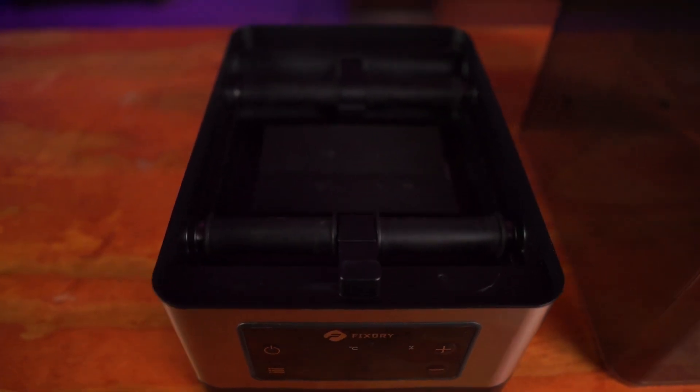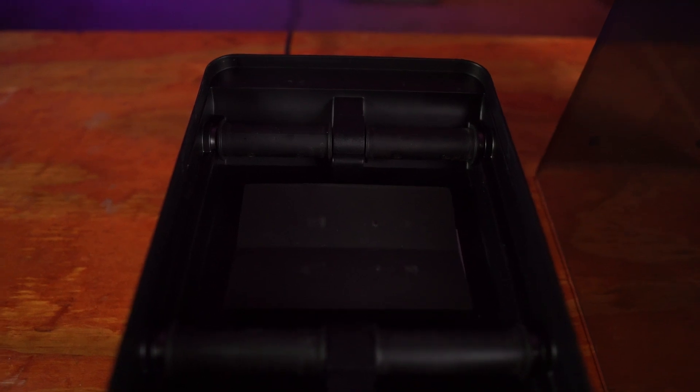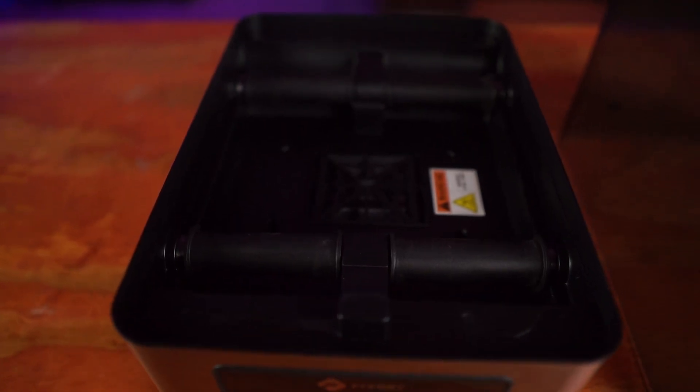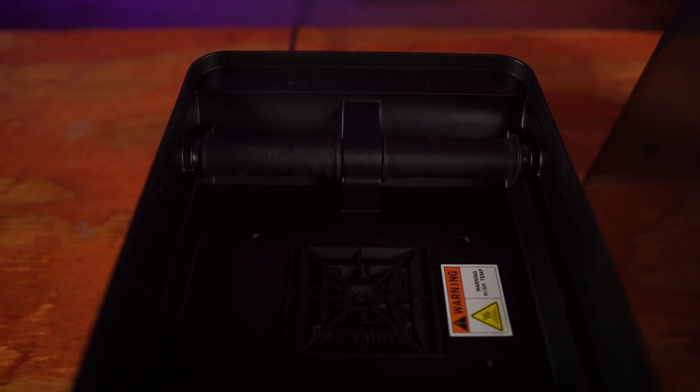The instructions for filament dryers say you want to dry out your filament for at least three hours before you start a print, and then you can also print while your dryer is going. I also figured out what that little plastic piece is for — it's a plastic shroud that you put at the bottom of the heating element. That way, if you don't want to use the dryer while you're printing, you can put the shroud in and it won't add heat directly, potentially ruining your filament. My advice: just leave the shroud in there anyway — it's not going to really affect your print either way.